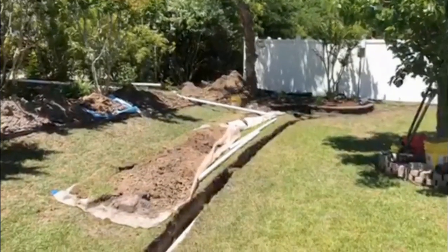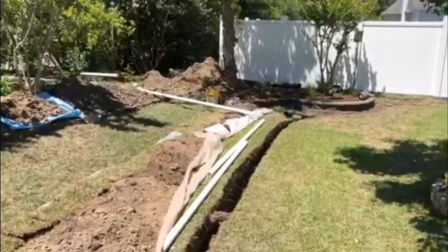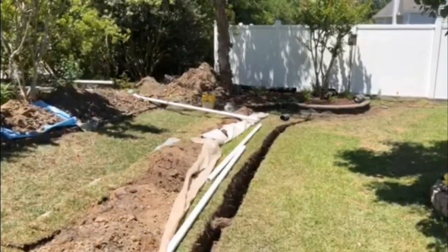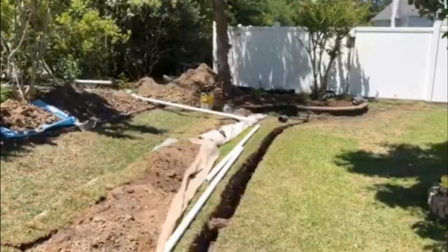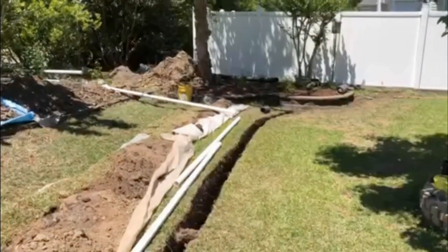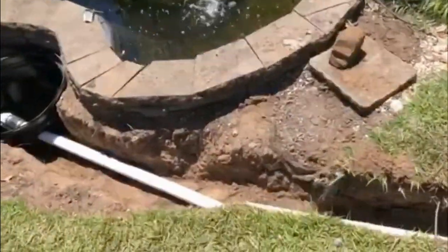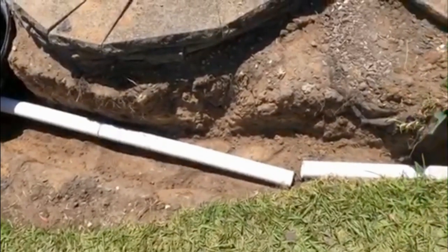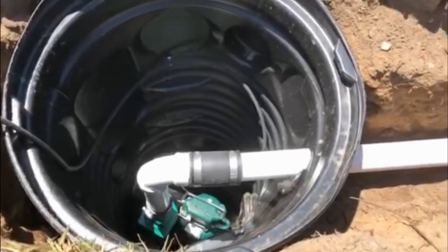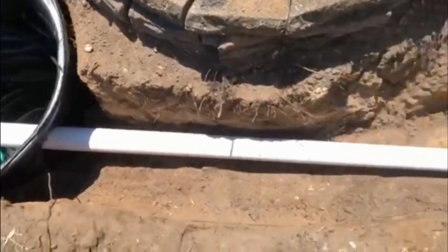I was happy. But I did discover back at the other end, where I connected the old catch basin and the new T, and where I connected the two pieces of pipe together, a little water was dripping into the trench line. I thought, oh my God. Then I remembered, no, these aren't watertight seals. They'll be fine. So I came down to the other end and I started backfilling to the level I wanted my discharge line. Then I put the sump pump together. I got my no hub out of the sump basin into the trench line. And then I discovered another problem I'm gonna have.